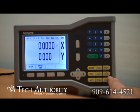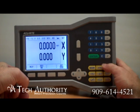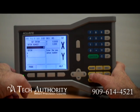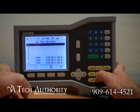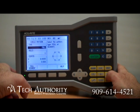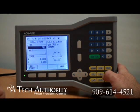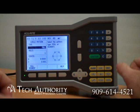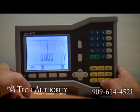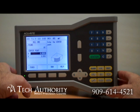Over here you've got your toggle switches — incremental and absolute, half. You've got the calculator built in or the RPM feature. You can set a datum and you have up to 99 datums. If you want to set up a tool table, you have different tools that you can load in. If you're looking to make a bolt hole circle pattern, you can do as many holes as you want and put in all the segments. On this one you've got the graphic illustrator so you can see what you're making. You also have an array, linear pattern, and a hotkey for making an arc.